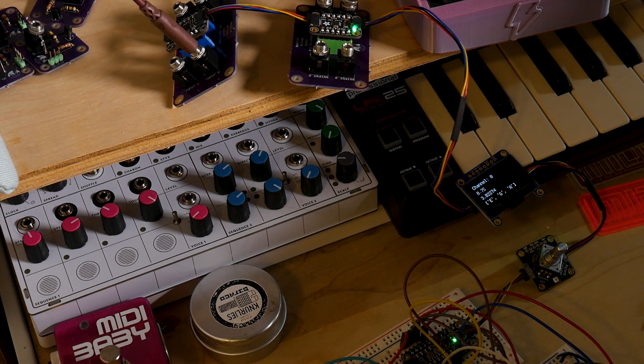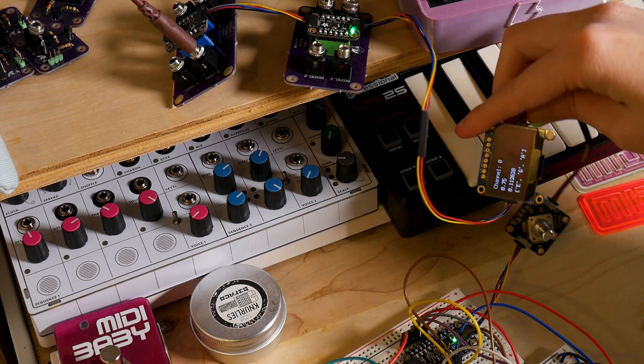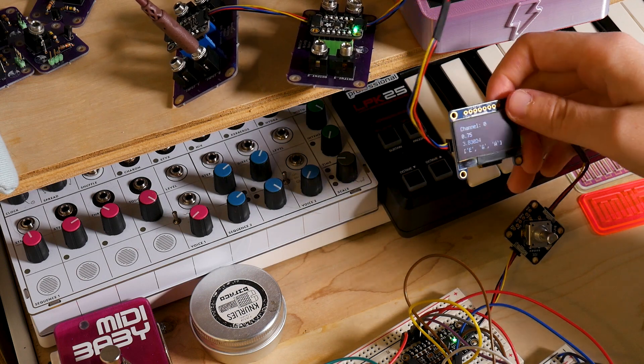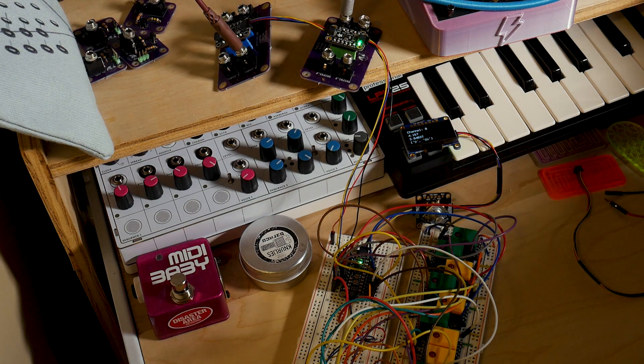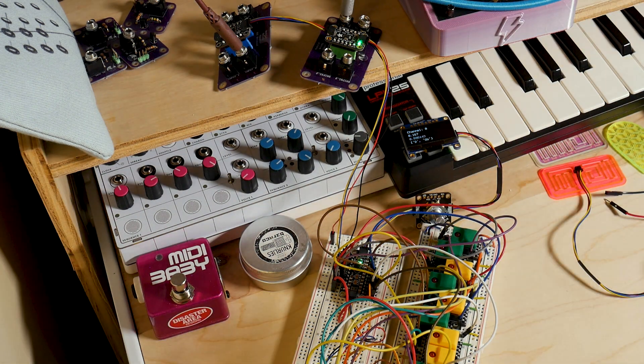The carrier boards are working, which is great, but I quickly discovered that the I2C daisy chain was still causing DAC output problems. So I changed up the stemma cable to plug the ADC and DAC into the Pico breadboard rather than into the free-floating components like the screen and rotary encoder.